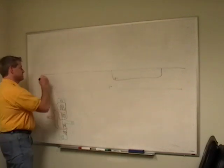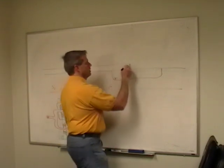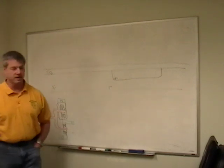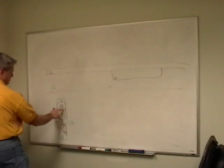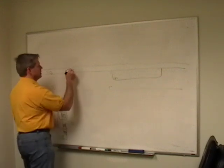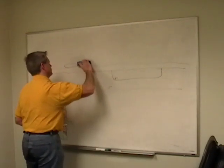But what they actually do is they let silicon dioxide grow for a self-aligning gate process. They let the silicon grow silicon dioxide on it. So you put it in a hot oven and blow pure oxygen across it, and it grows. And then they will lay down this stuff, which is your polysilicon, and it lays down here. Maybe I should draw it in red so we keep our stuff the same.